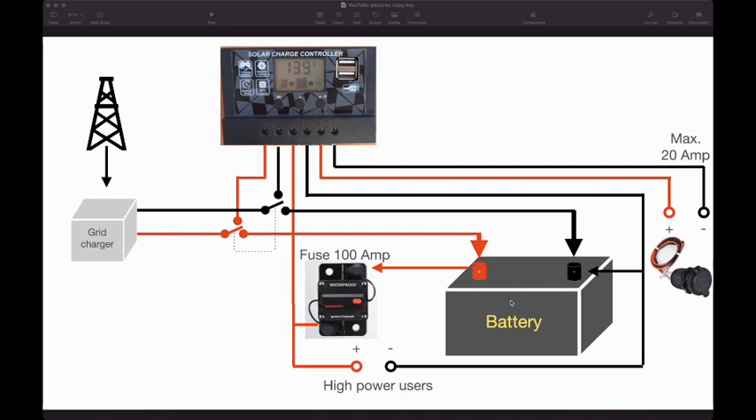The center of the system is the battery. It can be charged with high current directly by the grid charger, which has to be an intelligent device that knows the characteristics of the battery and is able to apply the right procedure. This charging intelligence is also present in the solar charge controller — not only for solar charging but for any device within a range of output voltage. This allows you to use a less intelligent grid charger to the two left connections, not more than 20 ampere. In the diagram you see the switch to choose for direct charging or via this solar charge controller — though you don't need a switch; it can also be a fixed connection if you have chosen your grid charger.